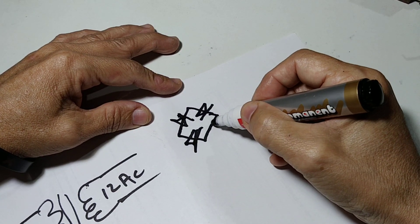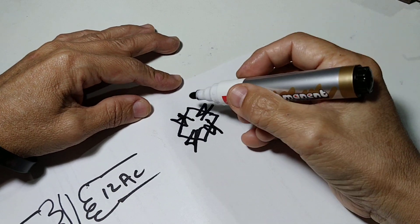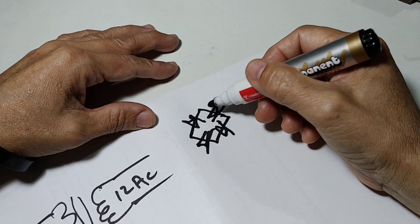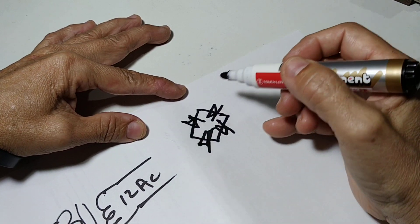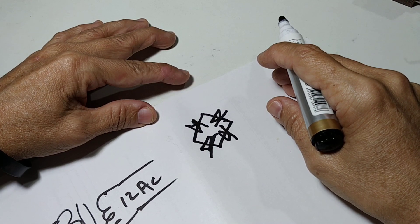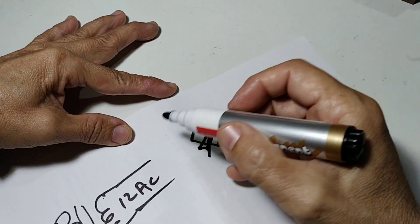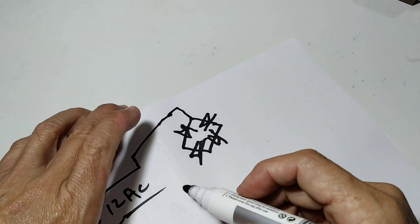Of course there are four diodes. As you can see: cathode, anode, anode, cathode — they have terminals. On one side you can see the cathode and anode. We know in DC, when connecting to DC in order to obtain DC, the voltage always flows in one direction because of the diode — it's not AC. Let's connect this 12 volt AC to the bridge rectifier diodes.